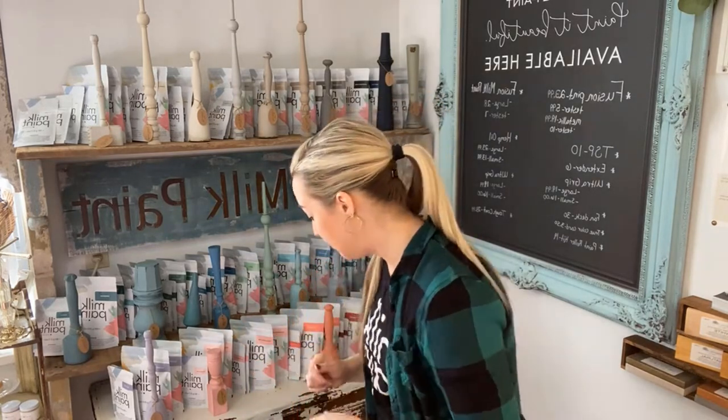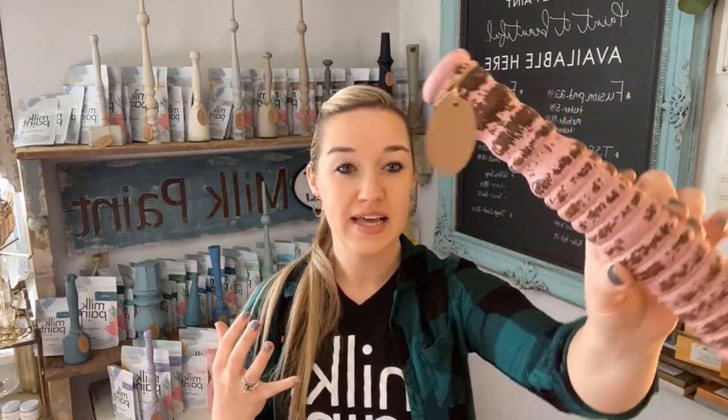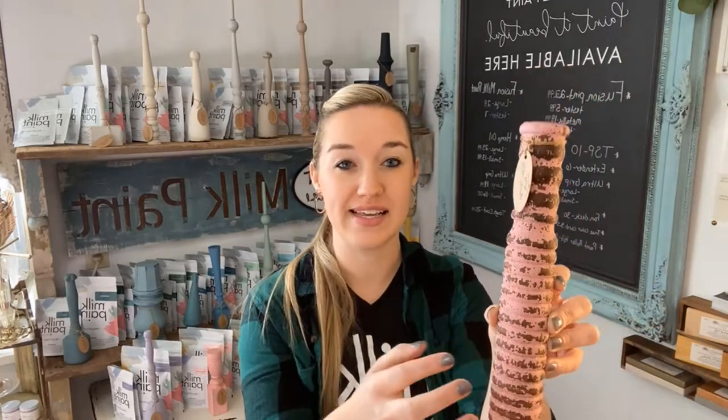When I said it kind of depends on the surface, I love to use hemp oil personally — but with milk paint, let's say we get a super chippy finish. There are top coats we don't want to use in that case. This piece here that I have as part of my display — I sealed it with hemp oil and it probably wasn't the best choice. This is still flaking off and shedding its paint, which means the hemp oil was not the most durable top coat for this piece. I always love to have samples and examples to show the fails.